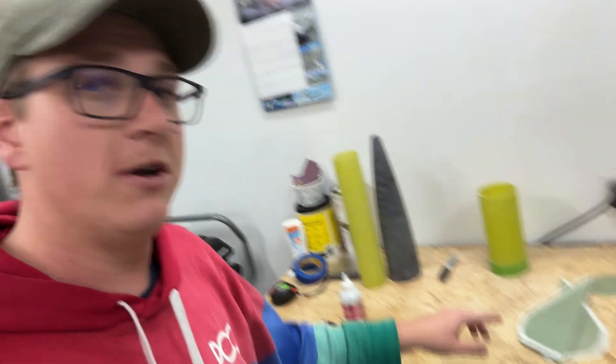Why not shake things up a little bit? Also, if you watch my channel, you'll know that I am sort of a hater of internal fillets in high-power rocketry. But a friend of mine who's an actual engineer suggested that internal fillets are actually more important than external ones, because you're dealing with the weakened structure of the tube once there are fin slots. The external fillets aren't mounted to as sturdy an object as the motor tube that doesn't have holes in it. So what we're going to do is make super beefy internal fillets, and the externals will be almost nothing but aesthetic.